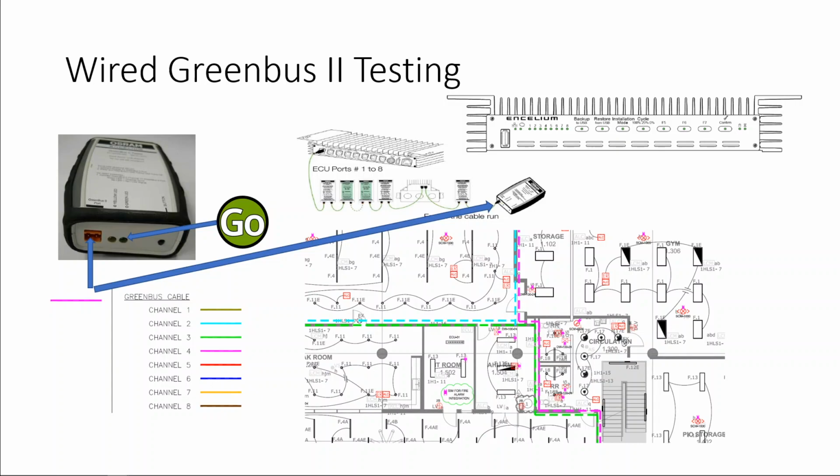We put the ECU or Extend Manager in the installation mode by pressing the button on the front that says Installation Mode. After pressing that button, the next thing you want to press is the Confirm button. That will put the Energy Control Unit or Extend Manager into installation mode. Then you click on the button that says Cycle, and it cycles between 100% brightness, 25% brightness, and off. To exit installation mode, you simply hit the installation mode button, or if left unattended for 10 minutes, it will exit the installation mode automatically.